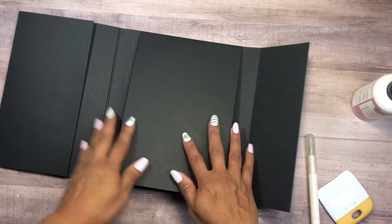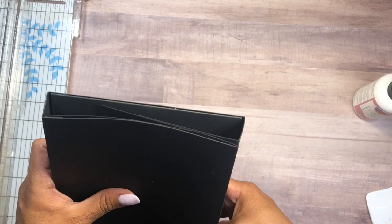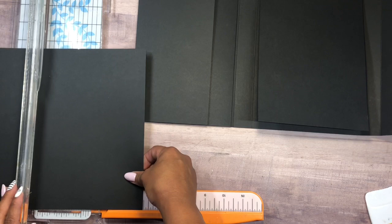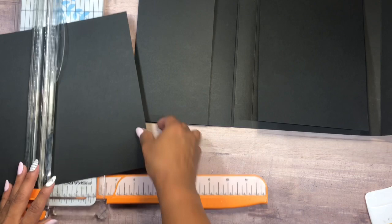I forgot to mention that this six-inch piece is actually a little bit smaller than six inches. When I cut it, I cut it not exactly at six but probably an eighth of an inch smaller, so I'm not touching my bending point — always be careful with that. It seems like six inches but it's not. I wanted to clarify that because we're going to cut more pieces to go on top. I'll cut another piece at six inches minus — let me check with my ruler — five and seven eighths.